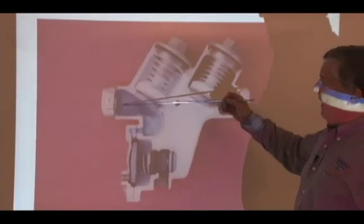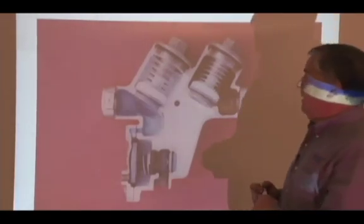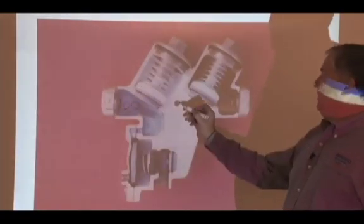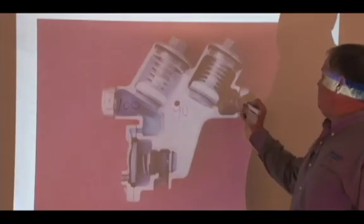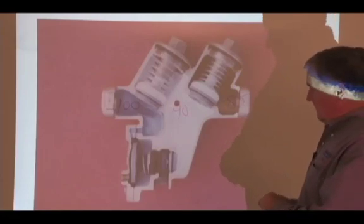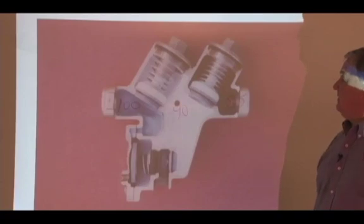So here's the water path. This is our high pressure coming in. Let's say we have 100 pounds pressure coming in from the street. Let's say we have 90 pounds pressure after that first check, just to make the math simple. And let's say after the second check, we have a 5-pound spring load to make it 85. These are just numbers for demonstration purposes, not indicative of this particular assembly, but just going through the numbers.